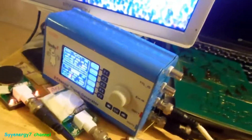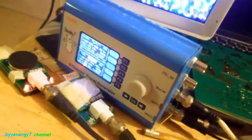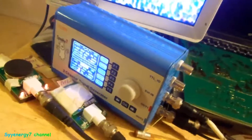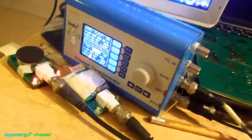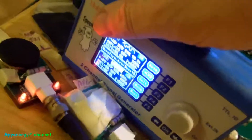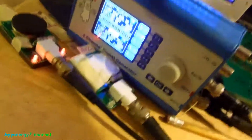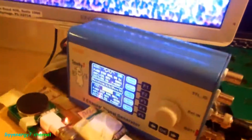This generator can turn on physically just from the USB connection on a computer. So if the electricity goes out, or you accidentally knock the power cord from the wall outlet, the generator will still be on. But that is not good for a certain chip inside it — that's likely been the problem, because it'll burn up that chip. The USB is only to send the signal from the program itself, not to power the device.